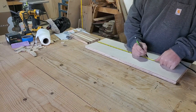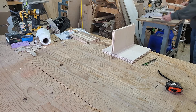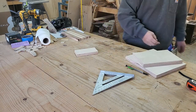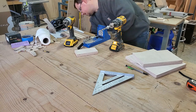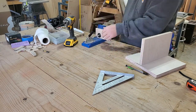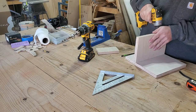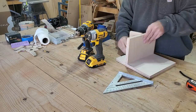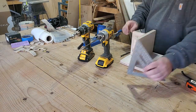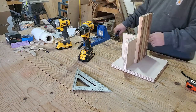At this point I need to figure out how to drill a hole down through the top of this thing. It needs to go straight down the middle of this board — not in the middle of the board, but like an inch away from the side or a half inch away from the side. And it needed to go straight down through the board about four or five inches, I think it was five inches. There was no way I was going to freehand that with the drill and not end up punching out the sides. So I had to build a jig — it's just like an L support that has a perfect 90-degree angle that you just clamp the board to it and then clamp it down to the table on the drill press.